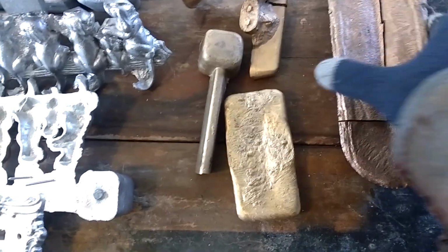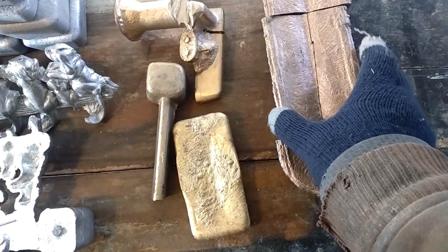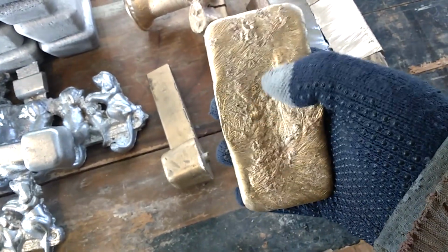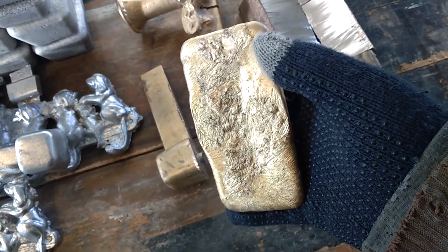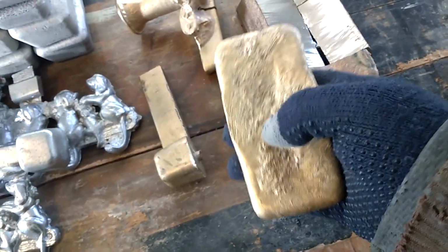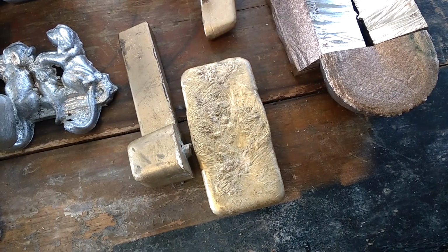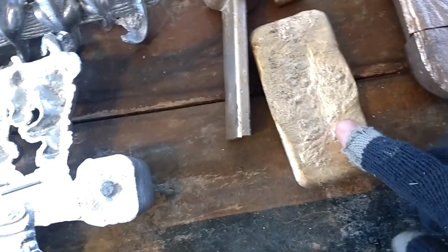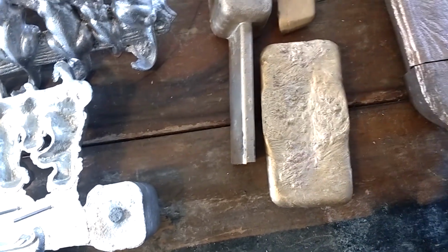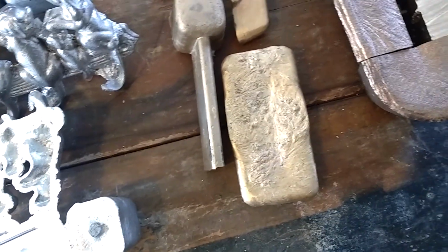Anyway, look at this ingot. It's nice and smooth, shiny. Right, not that shiny, but nice and smooth. Hit the top of it. Looks like gilded oatmeal. All foamy. This dross and foam stuff forms when there's the least bit of splashiness if you're working with aluminum bronze. A lot of people on YouTube are playing around, having fun, making their own aluminum bronze. This is actual stuff I purchased, and this is how it behaves when you pour it.